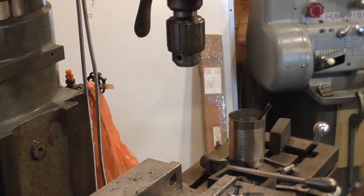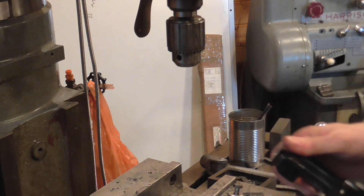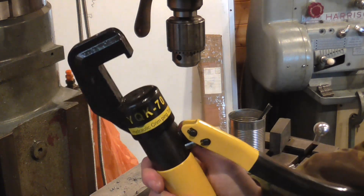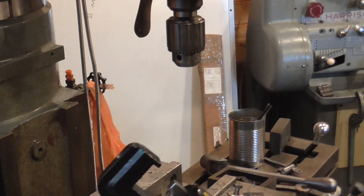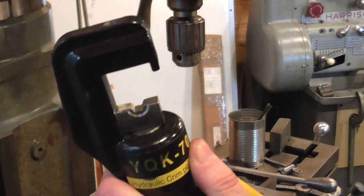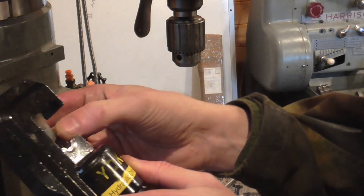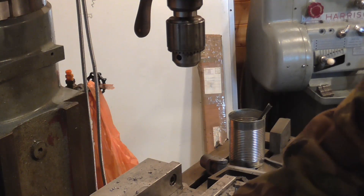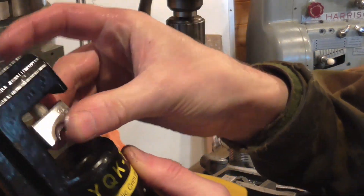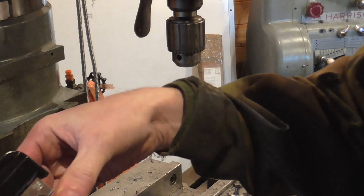Okay, let's reassemble this thing and see where we've got to. If I put in the bottom die — rather than making an adapter at this stage I've actually just got a bit of tubing pushed onto the upper die, which is a push fit into the hole. Let's try fitting the upper die first, then the bottom die.